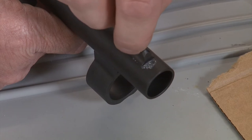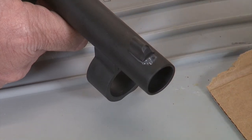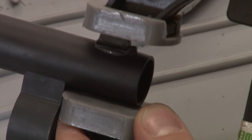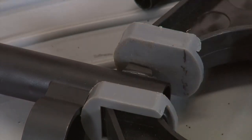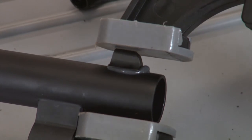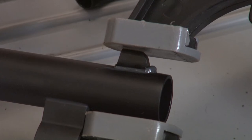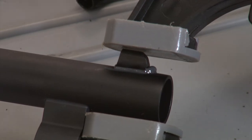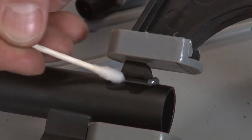I'm going to stick it down on here and it's going to squirt out the sides — that's fine. Then I'm going to grab a clamp and come in and clamp this down. There we go, that's tight. You can see some of the excess coming out. Then I'm grabbing Q-tips and alcohol and start wiping the excess JB Weld off.